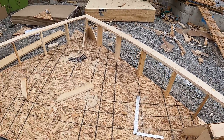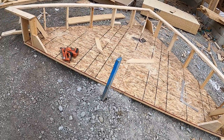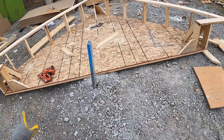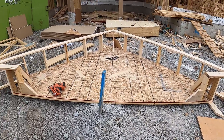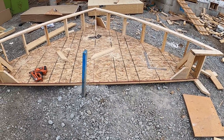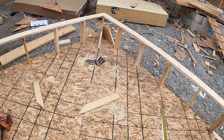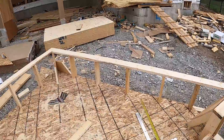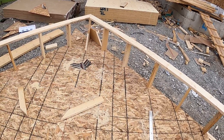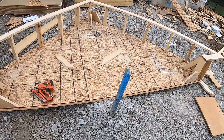Guys, I hope that helps in any way. Remember, don't go cheap on little braces — they take two seconds and they make sure everything stays nice and square and straight. I find it really helps out. Afterwards we're going to put a T-brace on the mid-span at about the four-foot mark right across, and then put another 2x4 on top of that — but that is after it's all stood up and set.